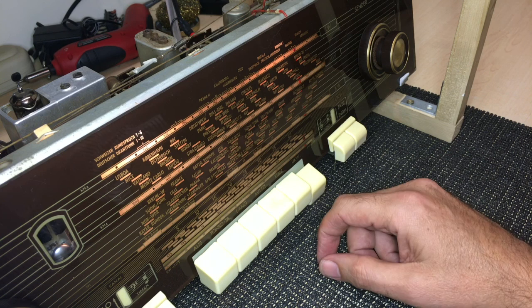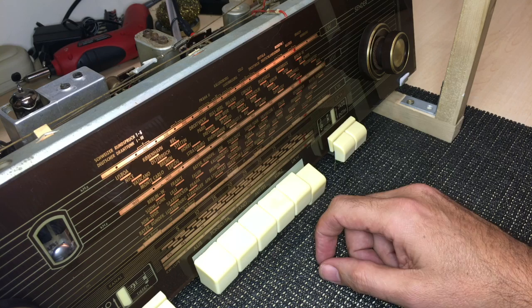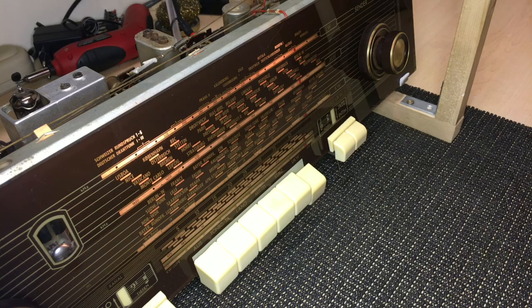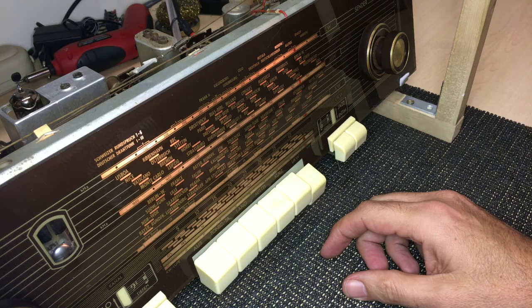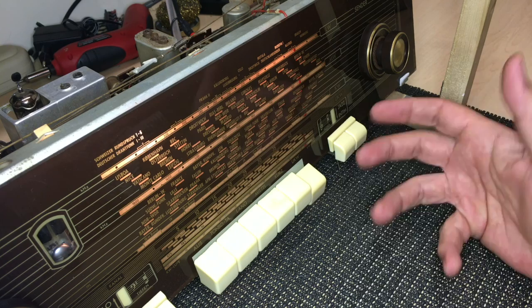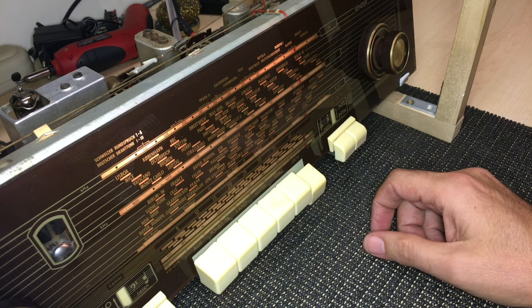I'm going to do a bit of videoing on it because somebody's asked me to show them how I go about it. It's not the how-to, it's the how-I. Everybody will have their own way. One thing I found out early on is the way to find out how to restore a cabinet is to do it wrong many, many times, and you finally get it right, because you're working with sanding down, the color tone that you put on there, acrylic, the varnish, lots of layers of lacquer, very fine sandpaper and wet sanding between layers.